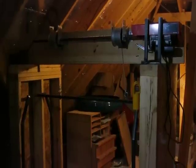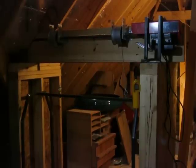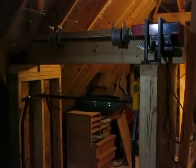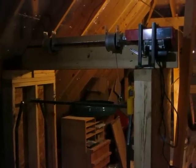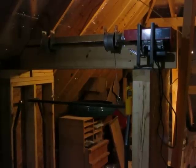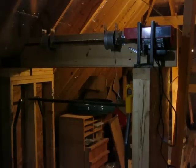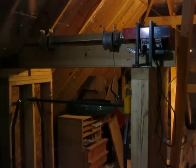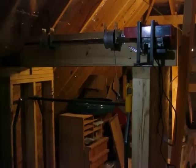the drum. I did get solid 1-inch steel shaft, nice and heavy duty, and I got 4 bearings to put the cable drums on. The way I attached the hoist to the shaft was I welded a metric socket on the end of the steel shaft so that it can mate up with the metric hex on the end of the hoist.